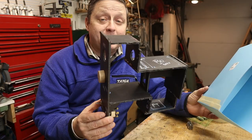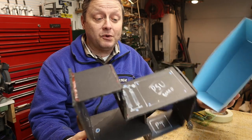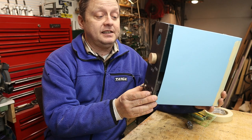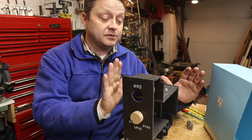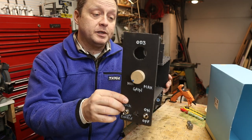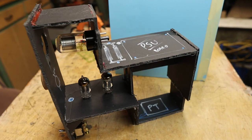The mock-up is all done and it turned out pretty good. Yes it's kind of crude looking but it gives us a really good indication of where all the components need to be and if there are any conflicts. It's basically going to slide perfectly in there. One thing I did realize is that all the cuts and assembly have to be perpendicular to the front or else it won't slide into this thing. We'll make the middle out of aluminum - easy to work with - and the outside will be made out of steel.